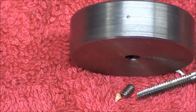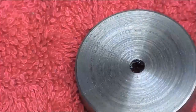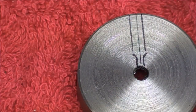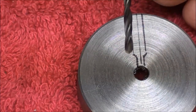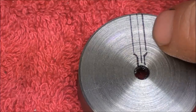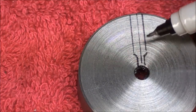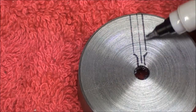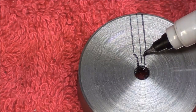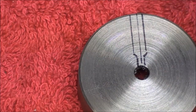Let me tell you a couple of things you ought to know when tapping into a rather thick piece. I'll drill all the way through with the tap drill size, and then use a clearance drill to enlarge the hole, so that only a small portion of it will actually be tapped. You'll surely break the tap if you attempt to tap full length. You only need about 4 or 5 threads at the very most — just this little area will be tapped, and the rest is a clearance hole. I'll drill that hole on the drill press.